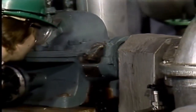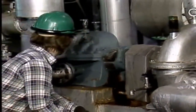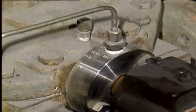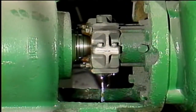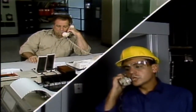The correct amount of leak-off may be different for each pump in a process or for each pump in a plant. You should be aware of the leak-off requirements for the pumps you're responsible for. If the pump has a mechanical seal, you should check to make sure that there is no detectable leak-off. Leak-off from a mechanical seal is an indication that the seal has been damaged and should be replaced. If you find a seal that is leaking, you should report it according to your company's procedures.